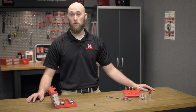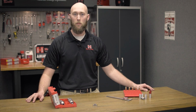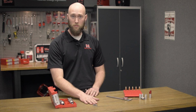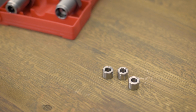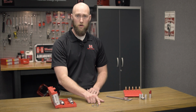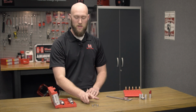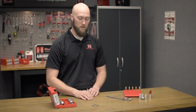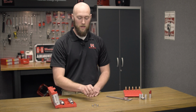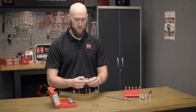The first step in working with any reloading dies is to make sure they've been properly degreased, which we already have. The next step is to select your bushing, which we've done in the previous installment. It's important to note that you always want to purchase the bushing above and below your desired dimension. This accounts for any unforeseen anomaly, like if your brass springs back more than 1/1000th of an inch, you can still load. The first step is to remove the cap.